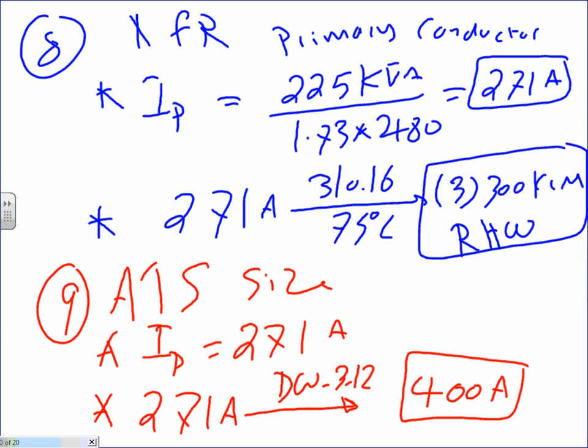Now, if you go and you find a manufacturer that makes 300 amps, then can I use a 300 amp here? Absolutely. Most likely, I'm using the disconnect table just to give you some type of a standard. I'm using the disconnect as my guide. But really, most likely you're going to find a 300 amp auto transfer switch. That's good. You go by the next industry standard.